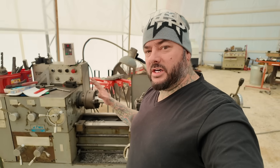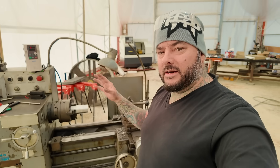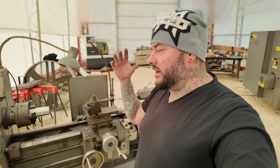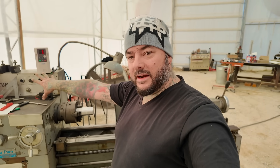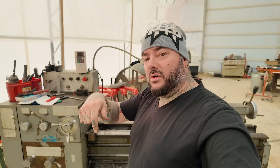In summary, this machine machines just as good if not better than it did on three-phase. I do have a phase converter here and could have used it, but I didn't want to deal with that every time. For anyone in a home garage with single-phase 220 — like a dryer plug — you can run most three-phase industrial equipment for cheap, without spending thousands of dollars. I'll leave a link to this VFD in the description. If you enjoyed this video, give it a thumbs up, subscribe, and check out my other videos.